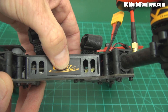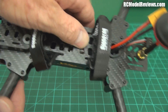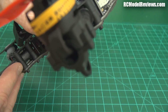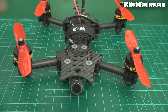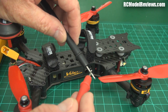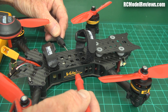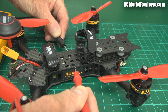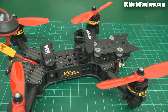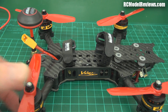The side panels are plastic. As for the top plate, let me verify whether it's genuine carbon fiber — you should hear a beep when I touch my probes together. Touching the probes to the carbon surface — yes, there we go. It's real carbon fiber, not carbon-clad fiberglass. That's a big point in favor of this machine, but the PDB-as-structural-member issue remains unfortunate.